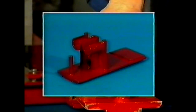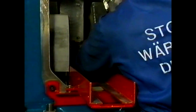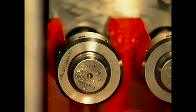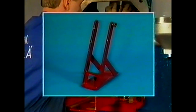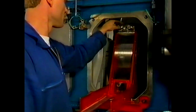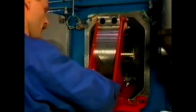Place at camshaft side the carrier under the upper bearing cap and connect it with the two nuts to the bearing cap. Now first remove at exhaust side the two lower nuts of the bearing cap so that the second carrier can be mounted. Pull up the blocking pin when the carriers are moved inside. Fasten the carrier of the lower bearing cap by turning on the blocking pin in the locating hole. During mounting of these carriers it is sometimes necessary to turn the crankshaft a little — always do this with the manual control of the turning gear device. When the upper nuts have been removed, both bearing caps can be pulled out.